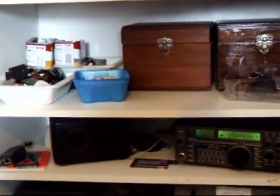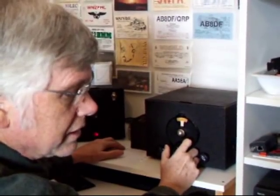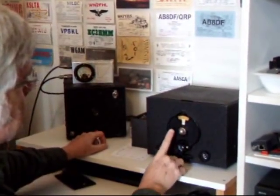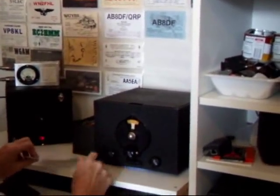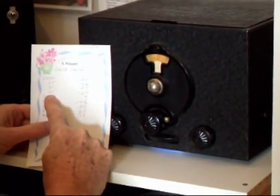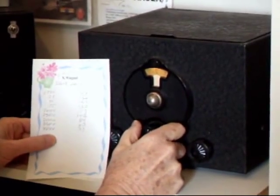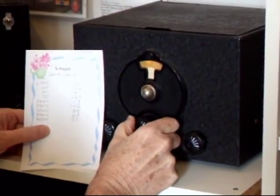Let's turn the volume up and carefully tune. There is the SW3 on frequency now, so the receiver is set and the transmitter is set. Take a close look at this dial — it's reading 120 on the SW3 dial. I've made a conversion chart: 120 was approximately 3575 kilohertz, and 123 was 3550 kilohertz. So 25 kilohertz spans the region from 120 to 123. Band spread is nothing like a modern transceiver, but it's good enough.